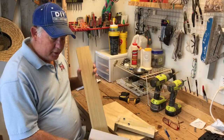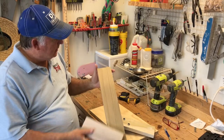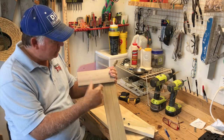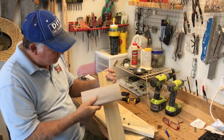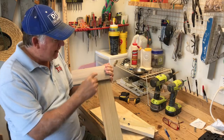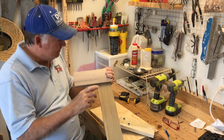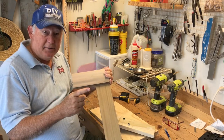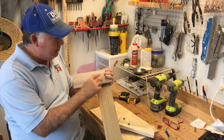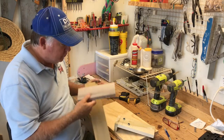So in my construction, I'm going to have these end pieces framed like here, and I'm going to have these cross members be like the ladder steps. They'll be here, then I have a spacer, and then I have another ladder step here. And so the issue was, how was I going to connect these into here other than just gluing? And I thought I'd add dowels as a technique that would be both supportive and architectural, add a little texture to it.